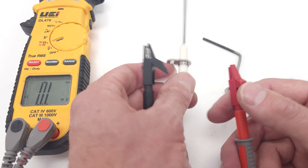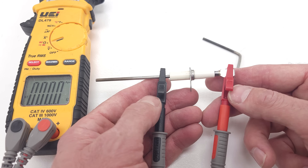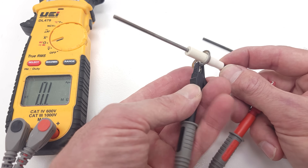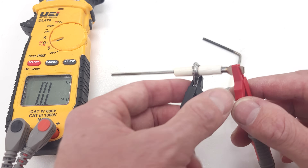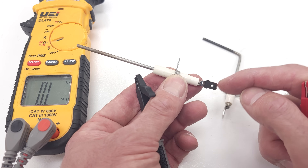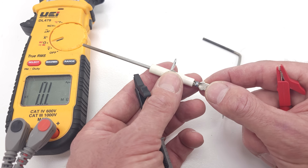For testing, clip your multimeter on both sides of the rod — you should read 0.0 ohms of electrical resistance. You also want to inspect it for any cracks in the ceramic, and take a resistance reading between the rod and the ceramic housing; you should read OL (open line) there. Be aware that the furnace supplies anywhere from 50 to 180 volts of alternating current to this flame rod depending on the furnace model — you can measure that with your multimeter.